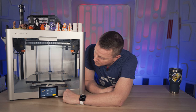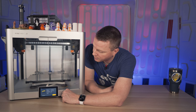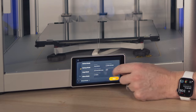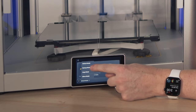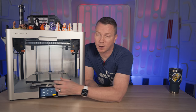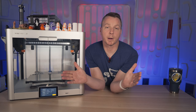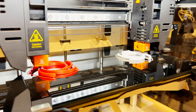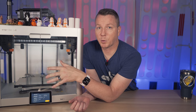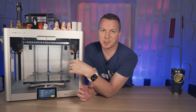I can see exactly how long it's estimated to take and general information like print temperatures for both the bed and the extruders. You can click and go to default mode, copy mode, or backup mode. Copy mode does one on the left and one on the right. Mirror mode also does one on the left and one on the right, but in the opposite direction — like there's a mirror in the middle, so when the left extruder goes left, the right extruder goes right, always moving in synchronized mirror fashion. Backup mode I believe is for if you run out of filament on one extruder, it moves over to the other.